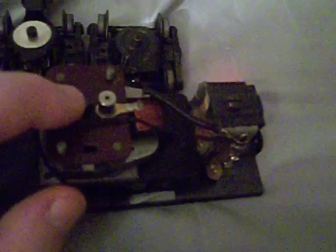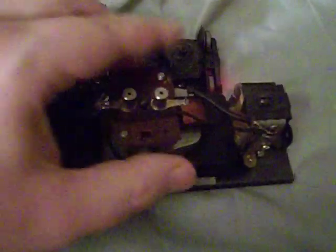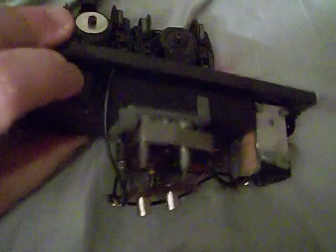You can see I soldered these not too long ago, but I forgot to get some new brushes and springs, which I'll show you what these look like here. But inside here, this is the brush plate. There would be two nuts that would hold this thing down. And if I can take this up without messing something up, I could probably show you. You can see inside there's your commutator. Your brushes and stuff are right on that commutator. As you can see, it looks brand spanking new. I resurfaced it, cleaned out the guts of it, and I cleaned out the guts of the whistle, you know, the brush holders.